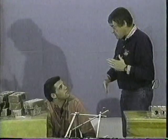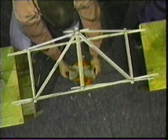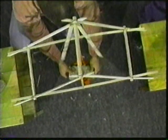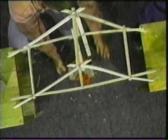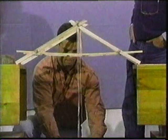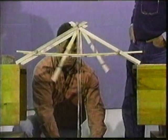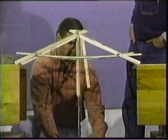We'll have to look at the slow-mo. This is a graphic example of members in compression — those two diagonals — if the thing distorts they'll fall out, and it could have been prevented by tensile members in the other direction. In fact, it is the slipping out of the members that happened first, before the ends broke. They're still intact at this point from the overhead shot, then they break at the top right-hand corner. The distortion allowed those members to drop out; they were not in compression but in tension and so were redundant in terms of weight.